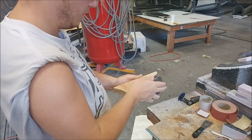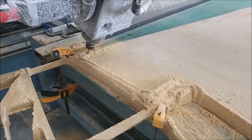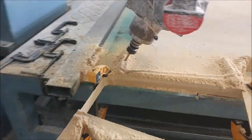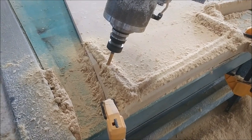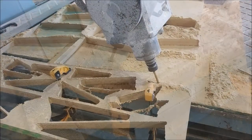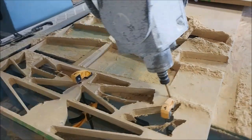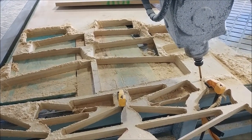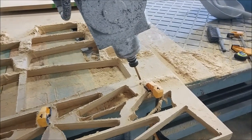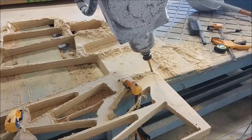They're all numbered so we're not losing track of what's going on. You're probably wondering why I'm using such a long end mill — that's the three-flute one I've used for a lot of this. I did order a shorter new one, but it got stuck waiting on a supplier and showed up literally the hour after I finished all the ribs for the wings and ailerons. Anyway, I've got a nice new bit now — the old one got a bit burnt from running hot.